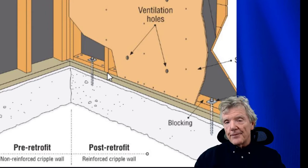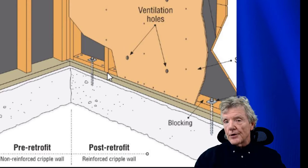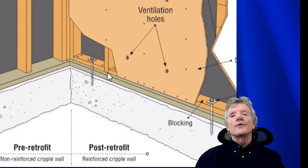And so the best option in those cases, if you can get the capacity, you just make the strongest shear wall out of staples that you possibly can. Make sure that the load is dragged to it however you have to do it. And then you can protect the entire front of a house with just a 6-foot-long shear wall without having to do a lot of foundation work, dealing with the porch and moving plumbing and gas meters and all that sort of stuff.